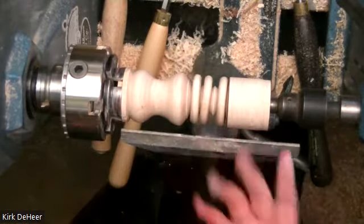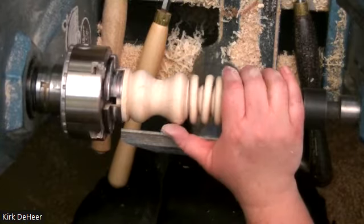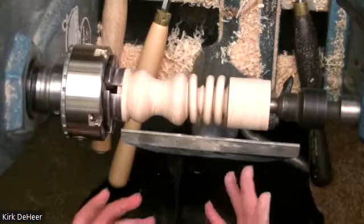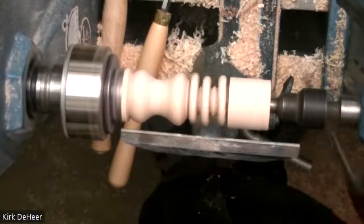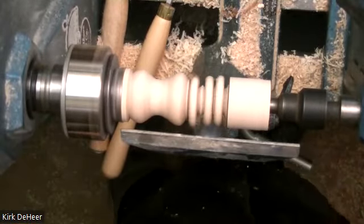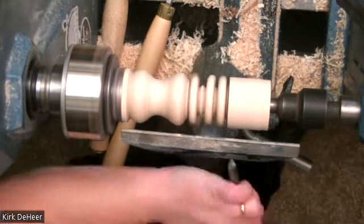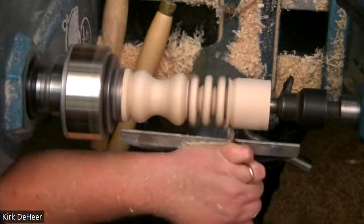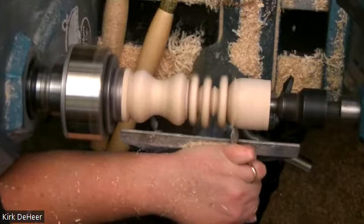No ridges. Now we're going to round over the head, finish shaping the rest of the rattle, clean up the spindle with our spindle gouge, sand it, and we'll be done — it's really as easy as that. We're going at about 2000 RPMs; at home I do turn these a little bit faster. But today we're slowing down so we can see. We're just turning a bead. I always say if you can turn a bead in a cove, you can turn anything.